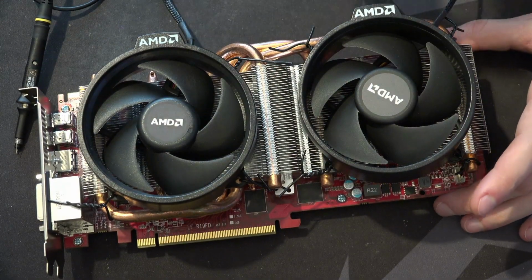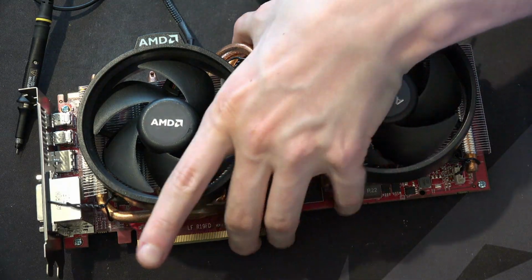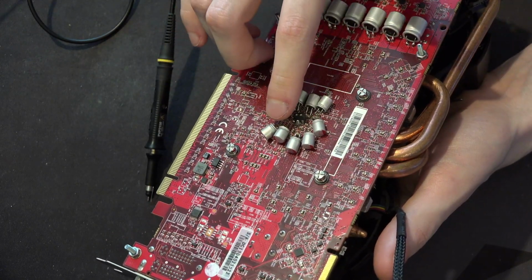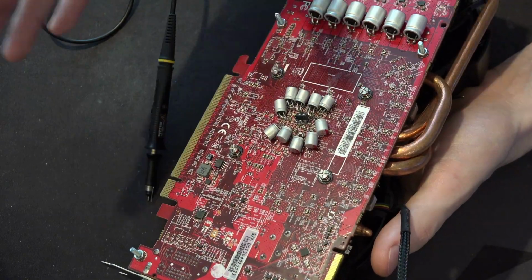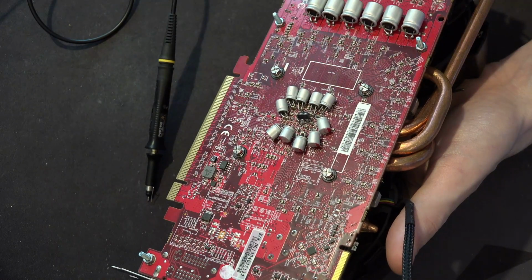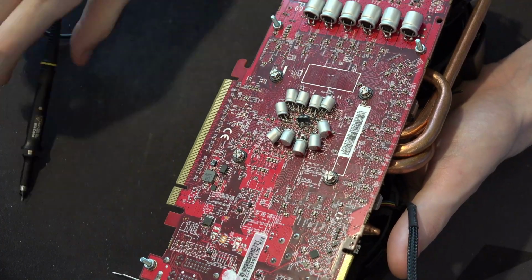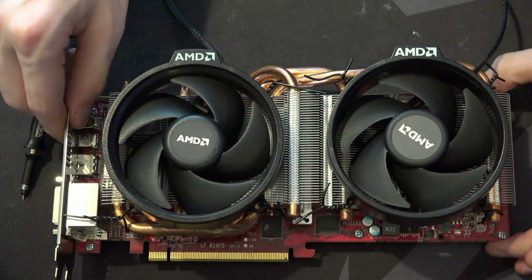If you'd like to support what I do here with actually hardcore overclocking, like buying arguably overpriced capacitors. I say arguably, because it might turn out that those $2 little tantalums are the best thing ever. If you have a really good capacitor, it could potentially have the same impact as 4 of these combined. If you could replace 4 larger caps with 1 smaller one, depending on what you're dealing with. In some situations, you just need more capacitance, but sometimes whatever capacitance you have doesn't have a low enough ESR or ESL to work. So potentially some really expensive tantalum polymers or aluminum polymers could work really well.